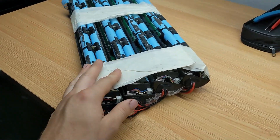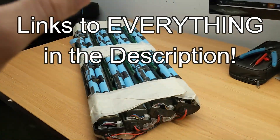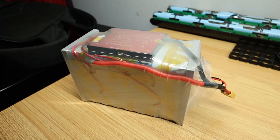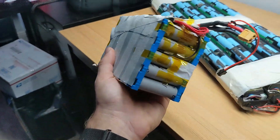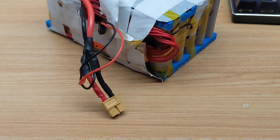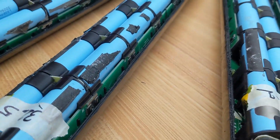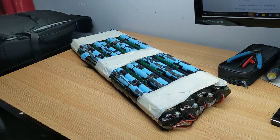What's going on YouTube? I just bought these used batteries from a website called Battery Clearing House. This video isn't sponsored, but I got them for a good deal because these are used and hopefully we can recover most of them with good capacity. We're going to be building a small compact e-bike battery for my project. This is going to be my second battery build. We're going to be using these LG MH1 cells and building a 10S 4P battery, which is a standard size for a 36 volt e-bike.